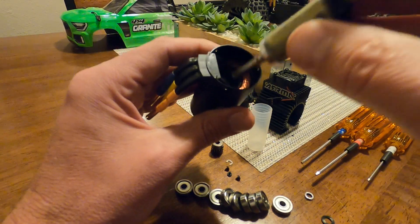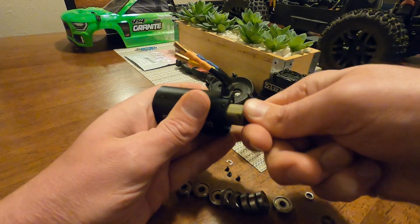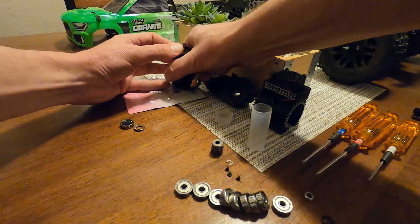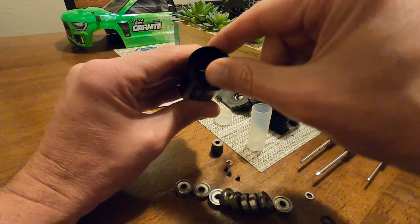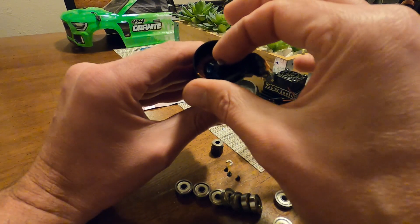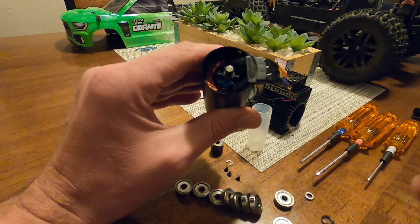We can go ahead and put the stator and rotor back in. It's really hard because the magnetism is going to make it jump around on you, so you have to find the center. Once you get that shaft through, come up and lightly press on the bottom of the shaft — making sure not to damage anything — and it will click the bearing in. The bearings are so important because if the rotor moves just slightly to one side it'll magnetically stick. The slightest wear on a couple ball bearings means it won't rotate properly, causing more friction, more heat, and noticeably affecting motor performance.